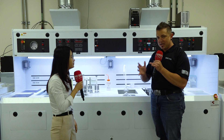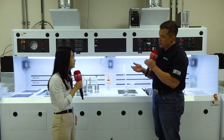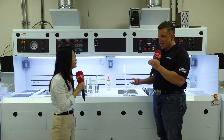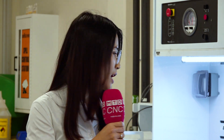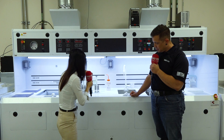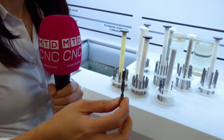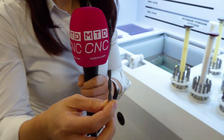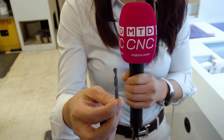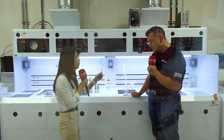Nobody wants their chips getting stuck in the cutter. So when you're coating the tools, are you just coating the cutting edge or what does that look like? When we're coating the carbide tools, we coat all around it. As you can see over here, we have one of the tools that's already been prepped. It's been prepped all around the length of cut, right here — that's where we're going to put the diamond coating on, so it will be very uniform across.